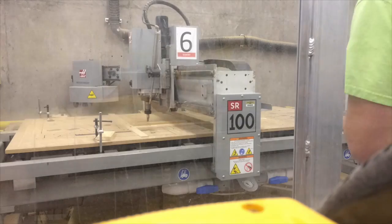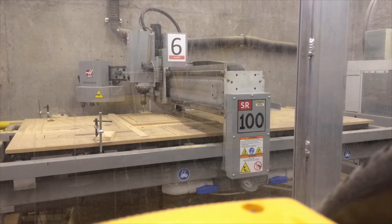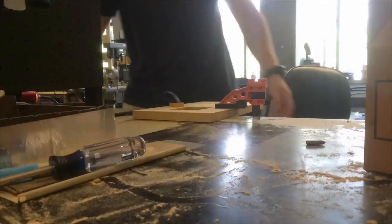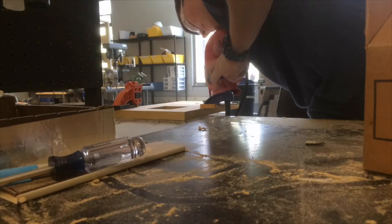The next step was to cut the wood. In the video, you can see the gantry hard at work. I was looking for preciseness, so I used the gantry as much as I could. This requires some previous knowledge of G-code and working with CNC type machines. The wood that I am using is called MDF, or medium density fiberboard. I chose this type of wood because it is very dense and results in low resonance.